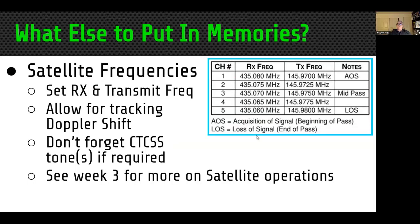Yeah, and please don't go into the weak signal part of the band. Yes. It sounds like it's empty because you're on FM and FM is insensitive to changes in amplitude. Sideband, AM, CW are all amplitude modulation, and you could be interfering with weak signal operations that you don't even know are there.